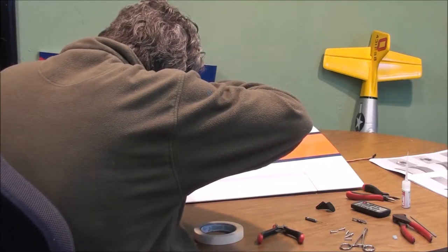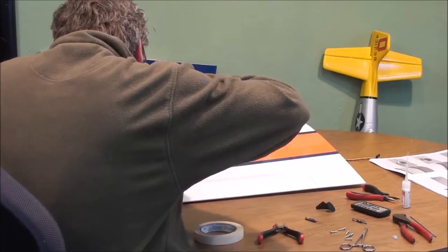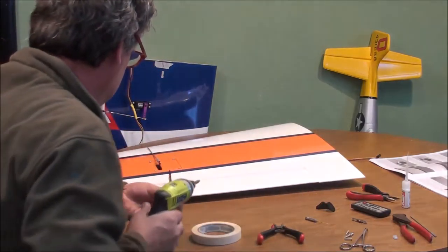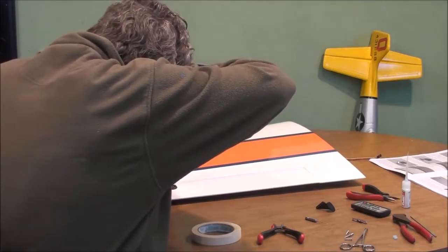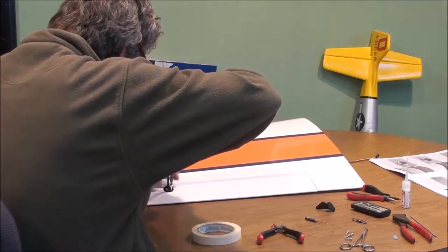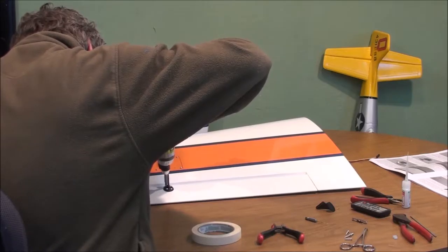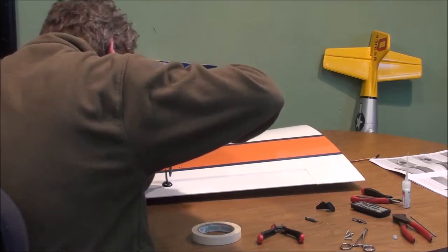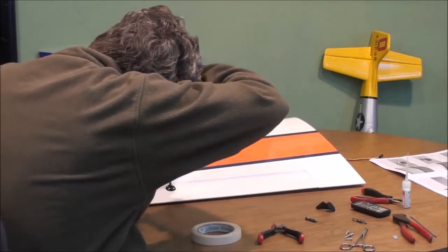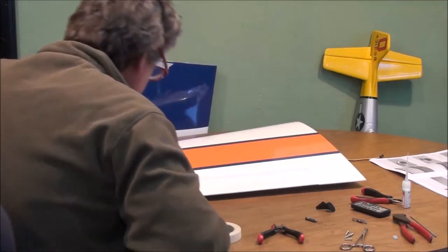I run the screws all the way up tight. I don't run them all the way up tight with my little drill — I probably could on a one setting. I'll try it; if it kicks out when they're fairly tight, I could probably get by with it. I usually don't. Make sure the bit is fitting your screw head well. It actually works. These are a little bigger screws. The clutch is pretty accurate — don't over-tighten them. You just want to start indenting the wood.